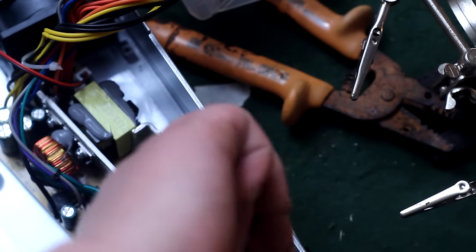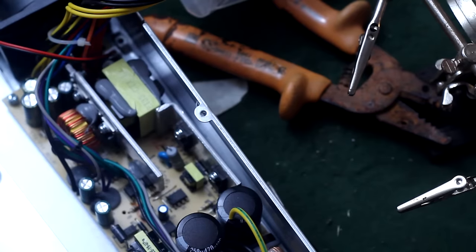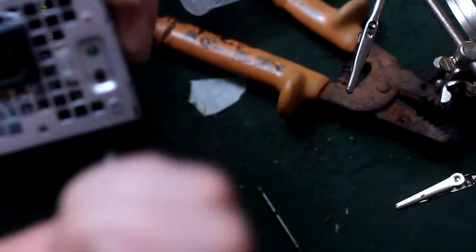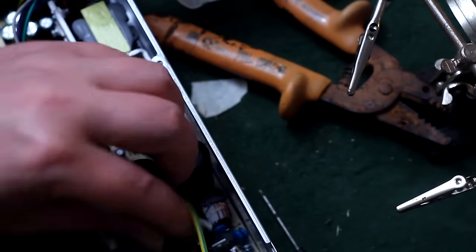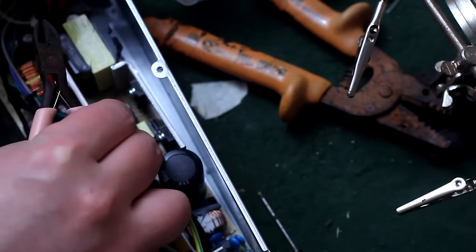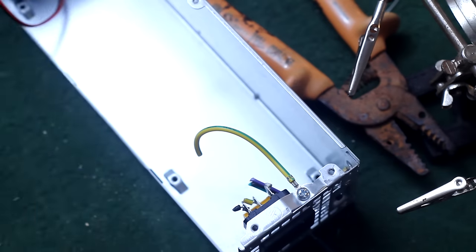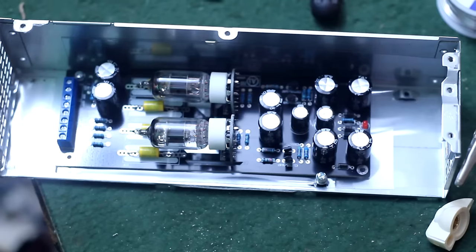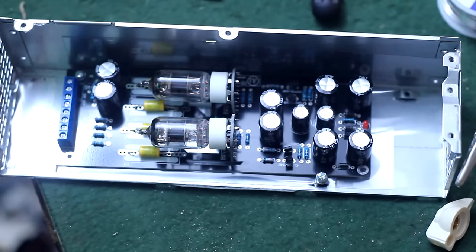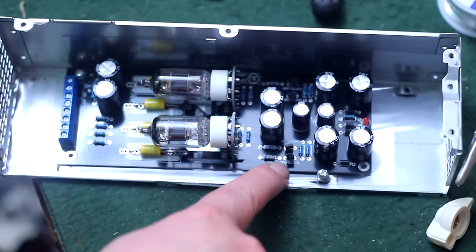It'll cool just fine. And the reason that I'm using a metal box is so that the jacks will ground on the box and it will create a Faraday cage around the circuit and kill the electromagnetic interference or hum. Since I'm going through two tubes, which is four gain stages, that's a big deal. But the power jack must be plastic because you can't have AC go into your chassis or it will cause hum. So now I was able to place the preamp unit inside of the chassis, and luckily I was able to use the original mounting points to mount it. This is where I got that big spark.